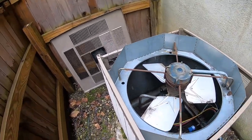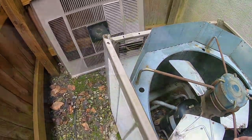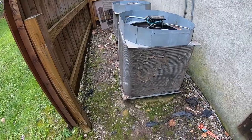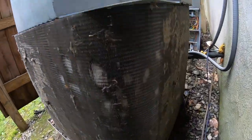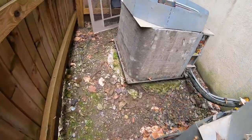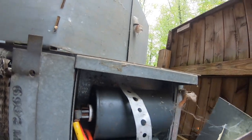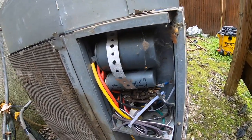I used this and took out eight screws from along here, and I'm going to take the pickup off. Okay, I got both of these off. Now here's why you need to do this every single year: I thoroughly cleaned this at the beginning of last cooling season — look at this. I took this off and cleaned the heck out of it, and look at it — it's awful. I actually thought about not doing it this year. This is terrible, terrible. Can't wait to clean this. That's what we got in there — can't wait to blow some air in there.